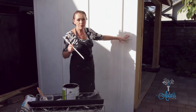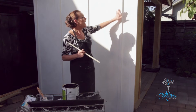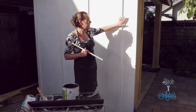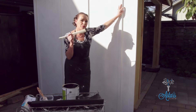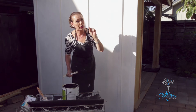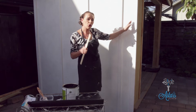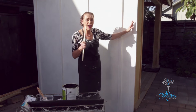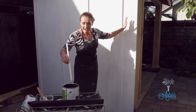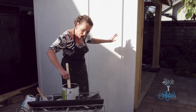Now I've shown you how to prep and get everything pristine and perfect before you go any further. This has been done for about three to four days so it's lovely and cured off and it's ready to go. Now I could have stained it, but Jamie the wee builder boy was just a little bit rough and we had to put in a bit more fill. When you use filler or any other kind of painted surface, you can't use the stain — that's the reason why I'm using the acrylic top coat.